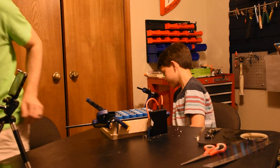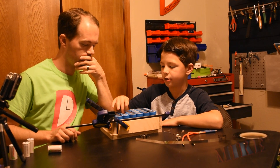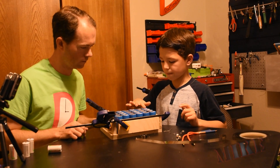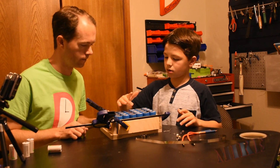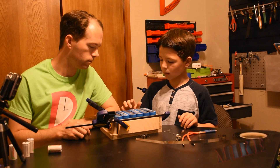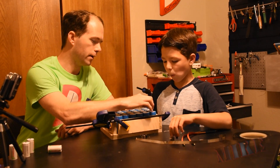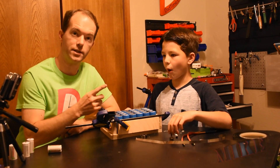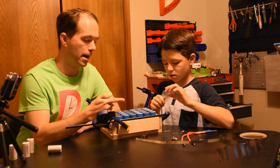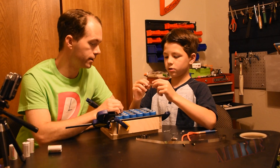See you on the other side. These tabs are looking pretty good. So now we've got to balance these, because we can't charge all of these and have the exact amount of voltage go to each cell. What we're going to do is weld a tab that comes all the way across the positives, then flip it over and weld on the other side. Then we get five balance wires for a 6S pack — one, two, three, four, five — and then two power wires, for seven total. Positive power will be here, negative power here. By tying them across this way, it treats each group as one cell so we're able to balance it — that's our 4P connection. If we don't tie them across, we can't balance them, and cells in the middle could do something really weird, like only charging up to 2.8 volts. So let's go ahead and install the balance wires now.